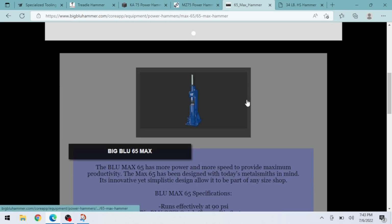Now, I don't have a picture here to show you, but this hammer actually cycles off of limit switches, if you will. So it has two little fingers on the top and bottom that set the stroke length. Some people like that, some people don't. That stroke length is adjustable, but not while you're running the hammer. So say you want to take longer strokes or make the ram run high for tooling, you have to slide and adjust the fingers higher, and there's a whole process to that.